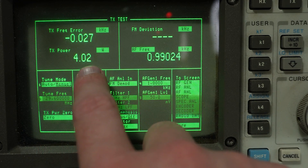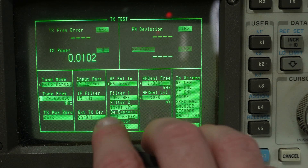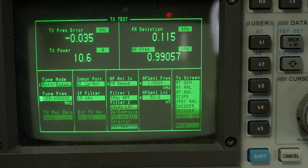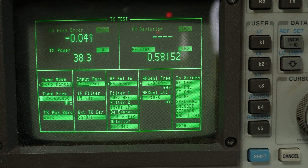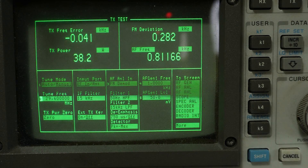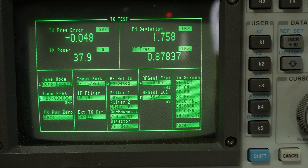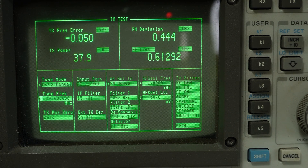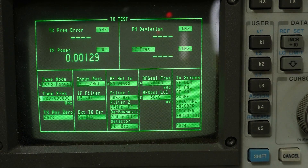On the test set at 29.600 MHz, transmitting on 4 watts: we're seeing 4 watts output and 2.8 amps draw. At 10 watts we're getting 10.5–10.6 watts and drawing about 4.1 amps. At 40 watts we're seeing 38 watts out and 7.4 amps. I'm transmitting for a while to check heat — the heat sink is warming up after about 15–20 seconds of transmission, so consider how long you transmit at 40 watts, especially on FM.